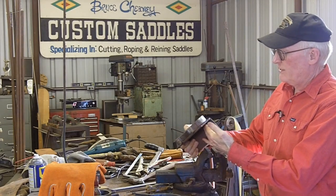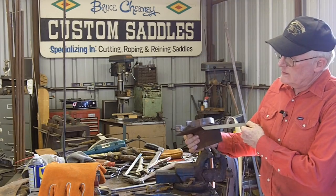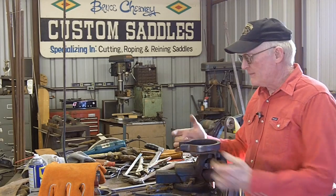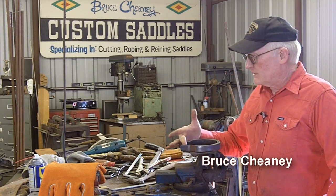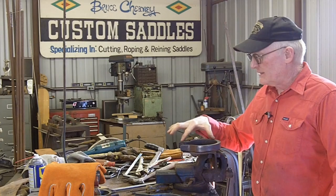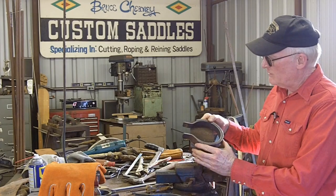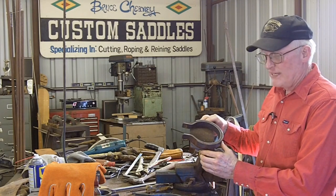The fixture I used is a piece of quarter-inch angle iron — I believe that's what you'd call four by four. I had to trim a little bit off so it fit down in my vise. I bent the stirrup shape around a piece of five-inch pipe, going up an inch and three-eighths straight up for the stirrup bolt or pin. I tacked this on the angle iron after I got the original shape, then came back and bent a shim that stays on there very snug for an overshoe Oxbow. I can take this shim off and bend a regular size Oxbow, which is about five and a half inches on the inside.